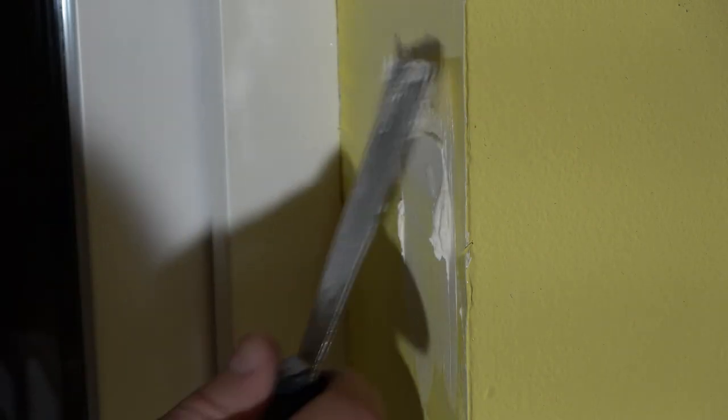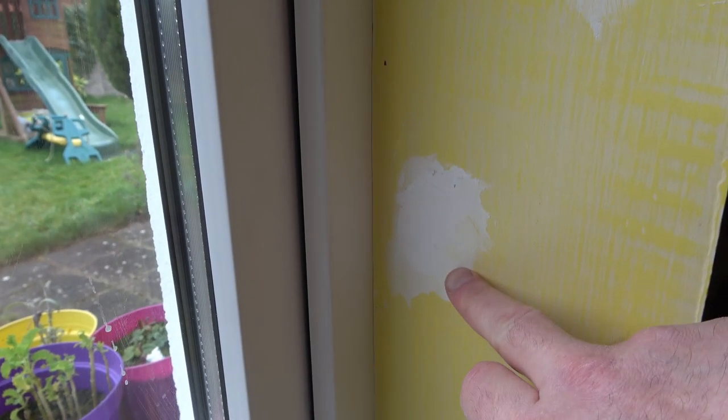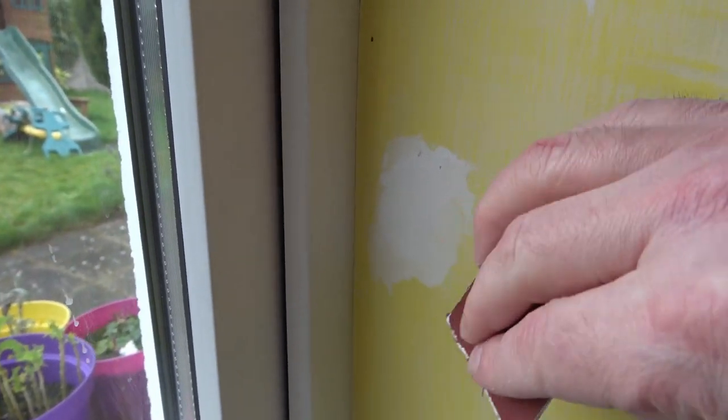This is too wet, but that's essentially the principle. What I might do is pre-spray everything to give it a chance to soak in so I'm not left with a mess and air bubbles and bulging. Once the filler is dry, the only thing for it is more sanding.